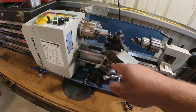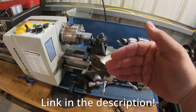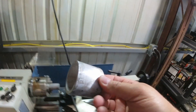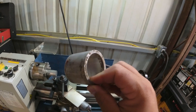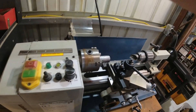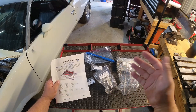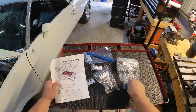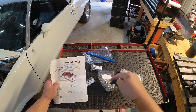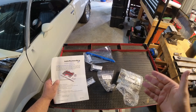The solution is there's an extension that throws about another inch on the diameter, which opens up my ability to turn things. For example, if I needed to take a chunk of round stock and turn it into a seal driver for bigger seals, like pinion seals, I need to be able to do that. So opening up the travel is the way I'm going to go. Straight from Little Machine Shop, these are all the parts I need to add at least an inch of travel to the cross slide — all the heavy parts, hardware, and any other fiddly bits needed.